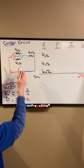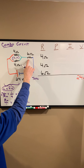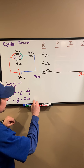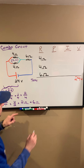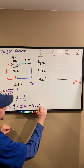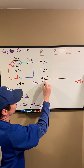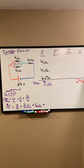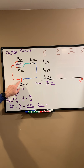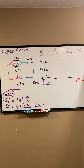Now, if that's the left side of this circuit at 2 ohms, notice that's in series with 6 ohms of resistance — 2 ohms in series with 6 ohms. The nice thing now is if we consider those to be in series with each other, we can just add those two resistors together. Left side plus right side in series gives us our total overall resistance for the entire circuit: 2 plus 6 gives us a total of 8 ohms of resistance.